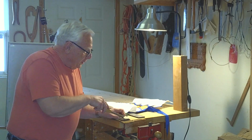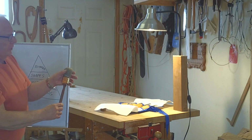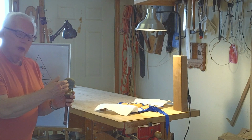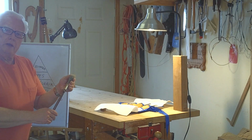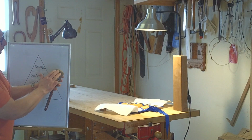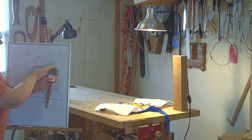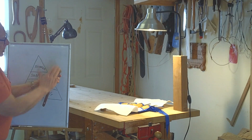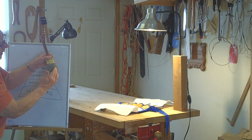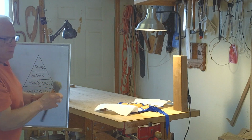the wood very nicely. Wood grain, the fibers of the wood are like the bristles in a brush. And if you keep that in mind, then you will always be going in the right direction. So if you were going to carve coming up on this angle of the brush like that, that's the right direction. That makes a smooth cut. But if you were to come like this, the bristles spring out. That's the wrong direction. So it's the same in the wood.